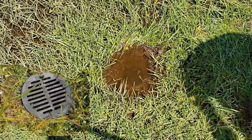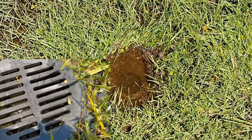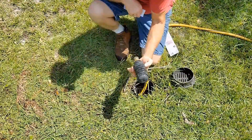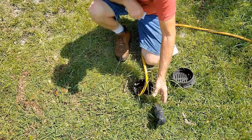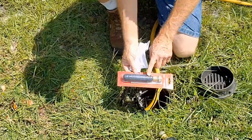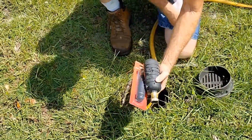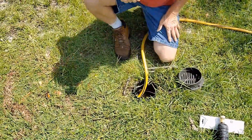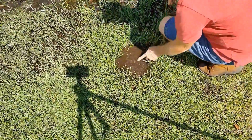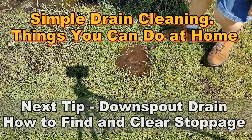That little $15 drain bladder — if you watched that video — wow, it is a lifesaver. And if you maintain that system and do this before the hurricane comes, you probably won't have a flood. This flush bag, this drain bladder, it's good for a 3-4 inch pipe, maybe 6-inch pipe. You can also get a smaller one — say you've got a sump pump discharge line that's only inch-and-a-half or 2-inch; this one here is designed for that, and I think it's $6 or $8. But you might not need these at all. All you really need is your garden hose. You see the flow? It worked really good. That's tip number one.